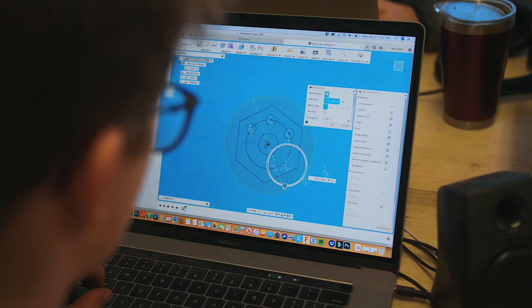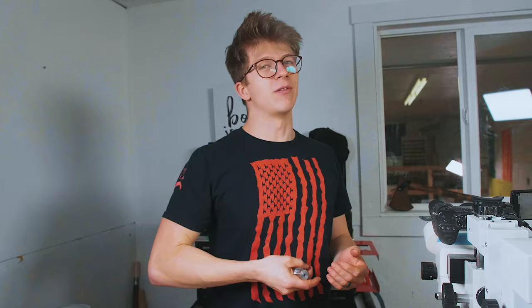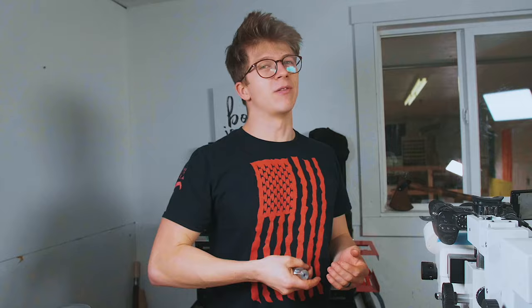So we filmed a whole load of stuff and it was garbage, so I'm going to sum it all up. Last time you saw me I was working away at the lathe, and I went through all sorts of ideas as to how I could make this work — from clamping it in a 5C collet block, putting it in the milling machine and roughing out all the stuff. I then went to Fusion 360 and tried to design it all out and get some measurements to work out where to plug in the numbers on the DRO on the mill. We're all the way now to where I've abandoned that hope and dream to just take carbide burrs and freehand out the Empire logo's negative in the stamp. It's way lower-tech than trying to get it done on the milling machine, but I would have no chance of success there, so lower-tech it is.